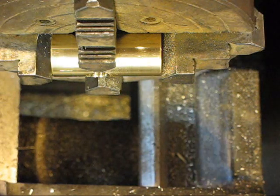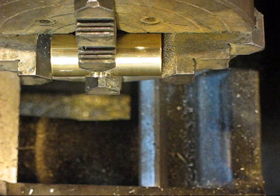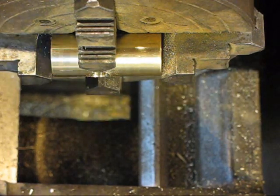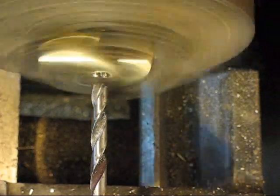So what I'll do is I have my 5/16 bit here. I'm kind of working with what I got, even though if I had a longer end mill, that would be perfect. I could flip it around, but it'd be a little tough to line it back up again perfectly straight, so we'll just finish it out with this guy. I only got maybe 30 seconds or so to go here, so